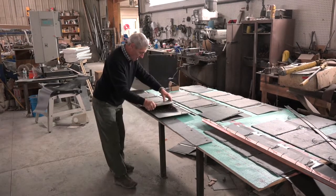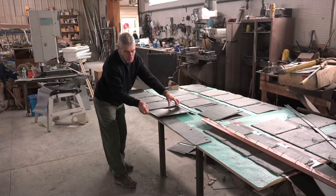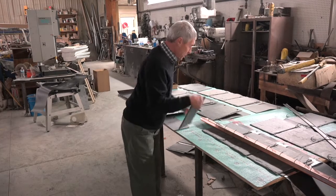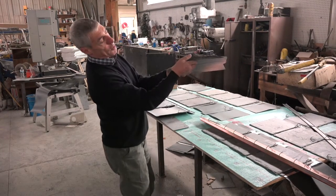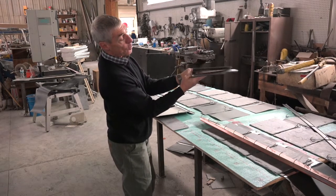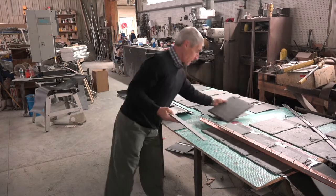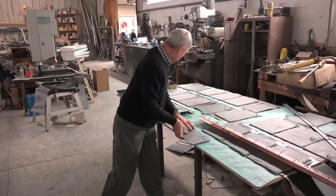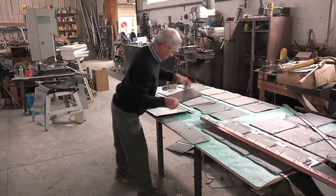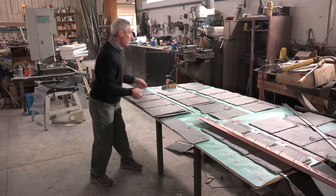Go across the row like that. That way you have that profile that shows from the ground — your two pieces of slate, which is what you like to see when you look up at your eaves. This type of profile: one slate upside down and the other this way. Together it's kind of like a clamshell, so it gives a nice finished look. Then you would put the 14 inch slates down, nailed individually, again traditionally on top.